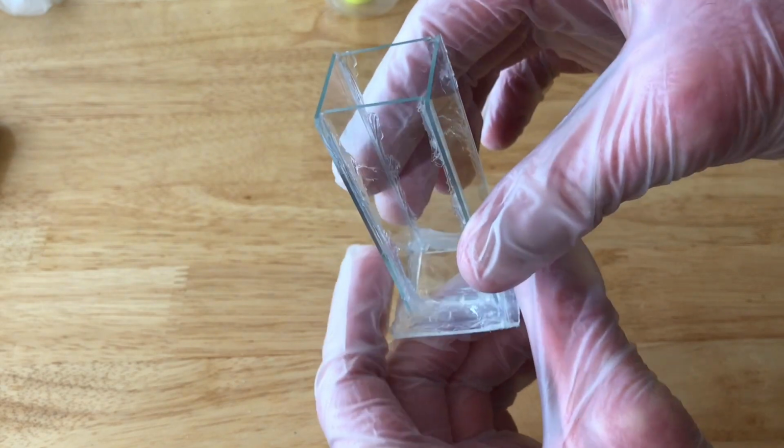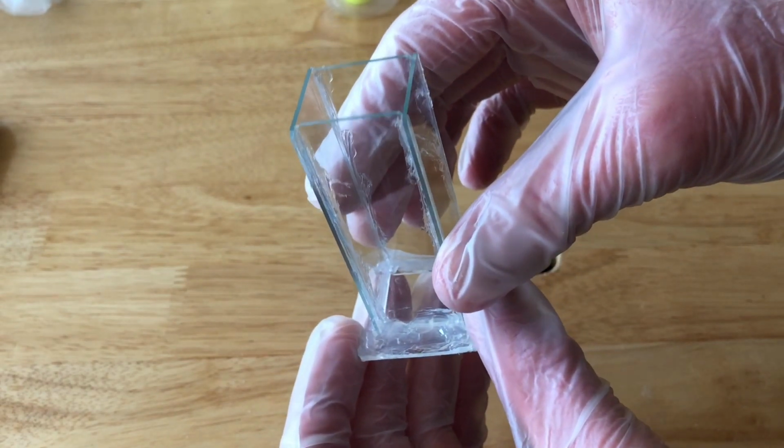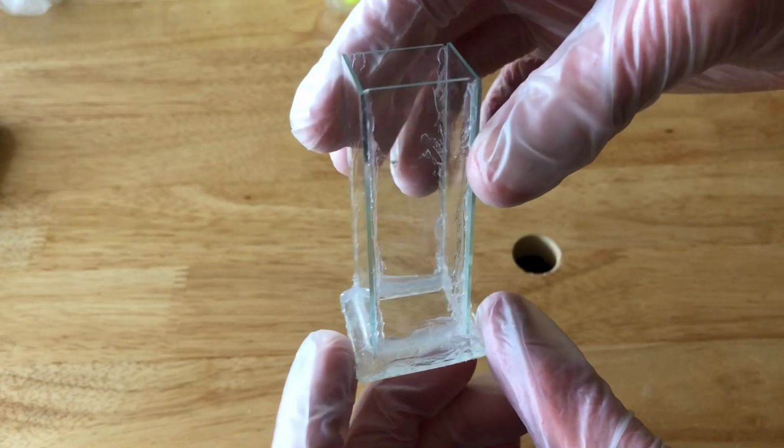A super radiant dye laser like this is a lot different from a laser that requires mirrors, like a helium neon laser or even a ruby laser. The dye laser is more like the nitrogen laser. It has an extremely high gain, such a high gain that the beam from the nitrogen laser can be focused on this tiny box, and just along that tiny length of a few millimeters, you will get amplification sufficient for a net gain and a super radiant visible output.